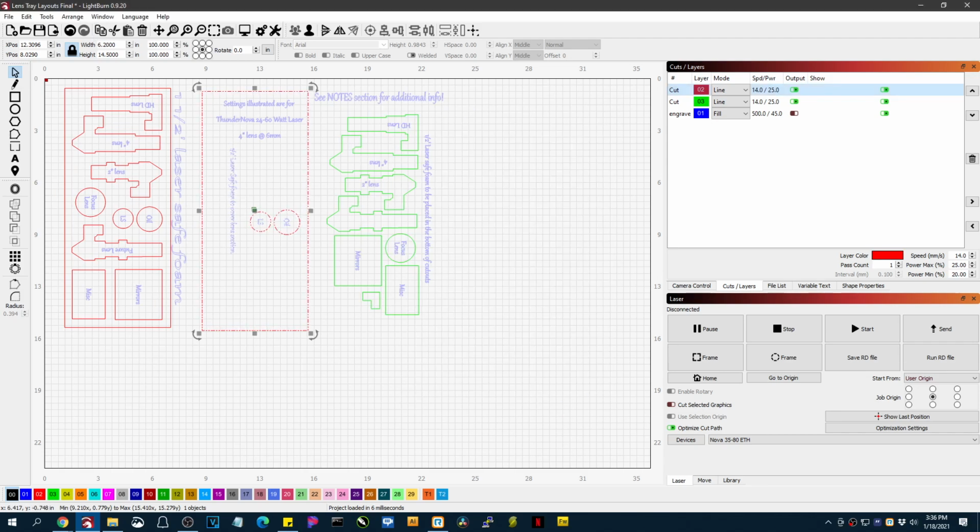You can also do something like, say you wanted to make that 6 inches, you could do 50.8 millimeters plus 2 inches, IN, plus 50.8 millimeters, and it would do that conversion for you in that basic calculation right there in the field. So you can pretty much toggle back and forth.